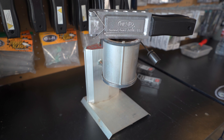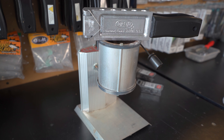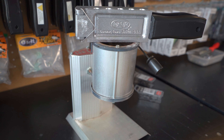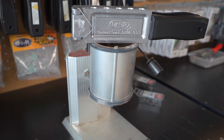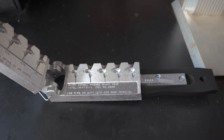Something that's really important is to always heat up your mold. Heating up your mold is going to help you get more complete pours more often, especially in the beginning, because a lot of times that mold is going to be cold, and as that lead goes into the mold when it's cold, it solidifies too fast and you don't get a complete pour out of your jig head.